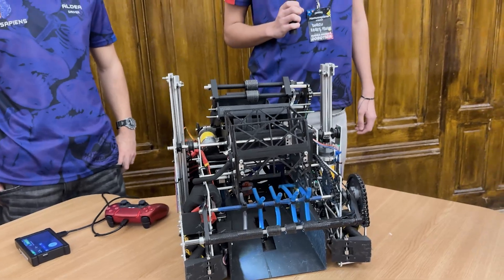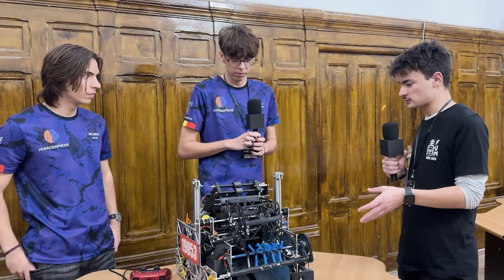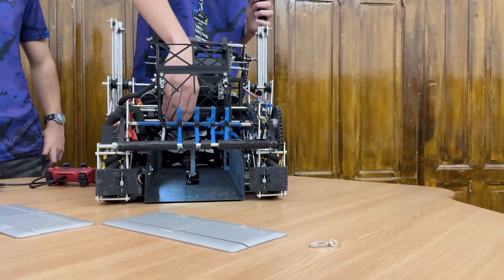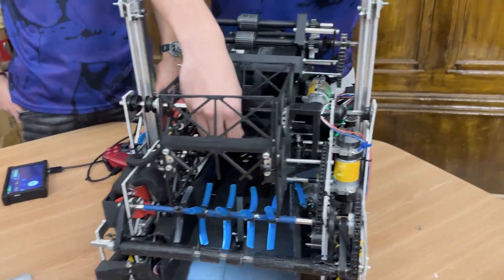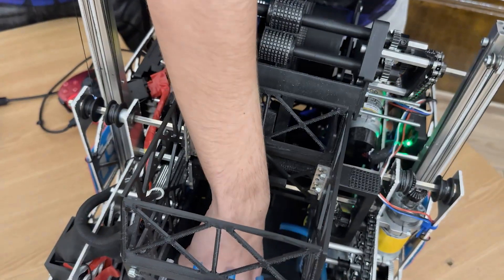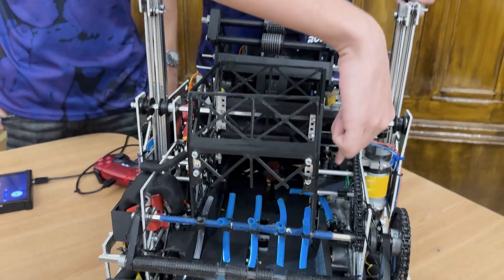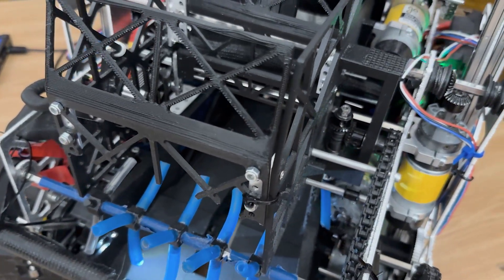And after the ball goes into the robot, how do you proceed to the shooter or to sorting? If you want to sort, we have a servo right here at the bottom of the ramp that goes up and guides the ball inside of the sorter. When we want to exit the ball from the sorter, we just flip this servo right here, which allows the ball to fall. Then we use this to create an angle so that when we reverse the intake, it's pushed down inside of the robot. If you want to transfer into the shooter, we have an active indexing connected to the intake that rotates to push the ball further inside of the robot.